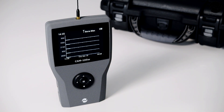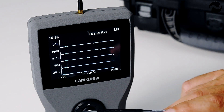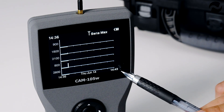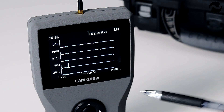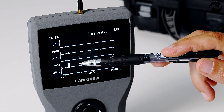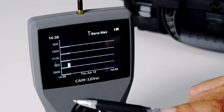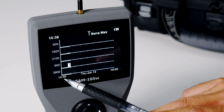If we go up to the graph screen we can see on the left-hand side the five cellular bands. The start time is 2:35pm and the end time is 2:43pm, so we have an eight-minute live scan of all the signals going across from left to right. You can see we're already having a signal plotted on 800 megahertz from the mobile phone just next to me, while the other bands remain clear.